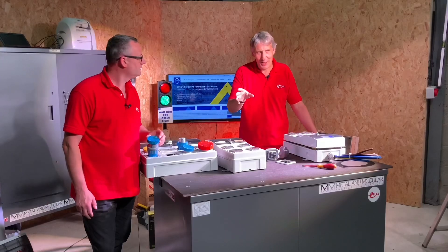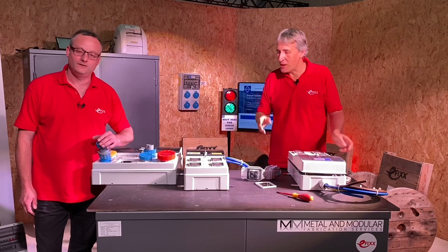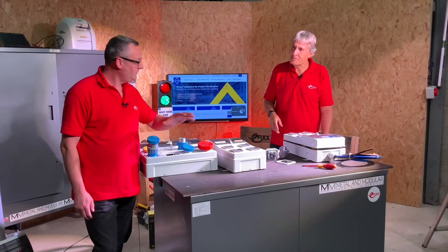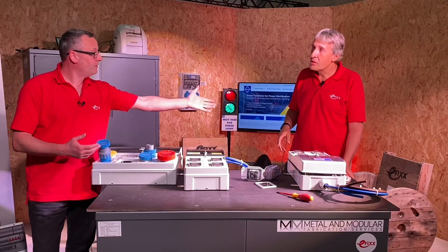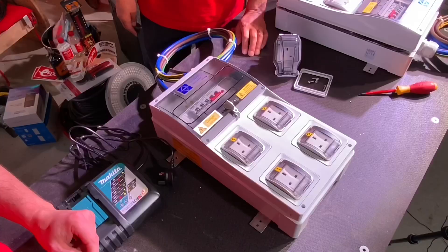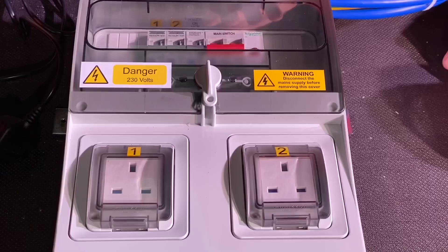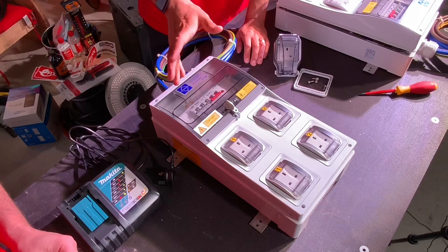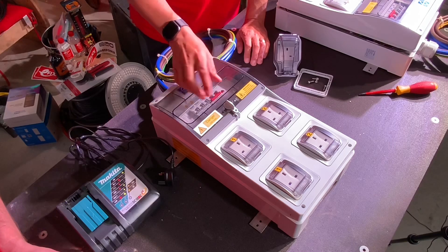On a smaller installation you're likely to have a transformer and be plugging into a 230-volt socket outlet anyway - or in real terms perhaps plugging in charging units for battery tools used on site, maybe some temporary lighting. So we ditched the 110-volt from this design. This is a place to plug in the kettle, plug in your own 110-volt transformer - you don't accept responsibility for anyone else's banks of chargers. Let's go through some of the wonderful features incorporated in this Top Tier prototype.